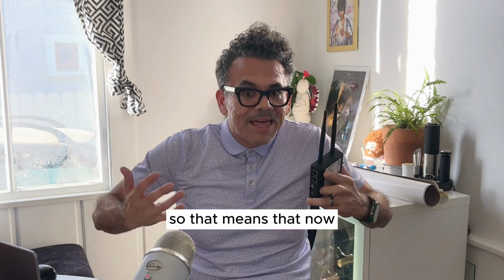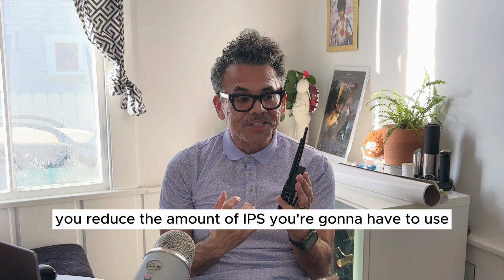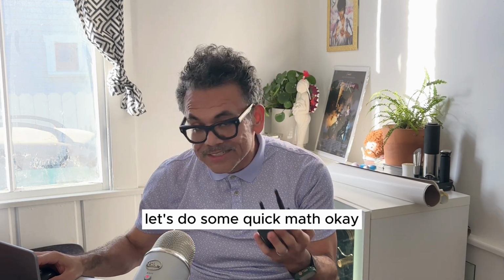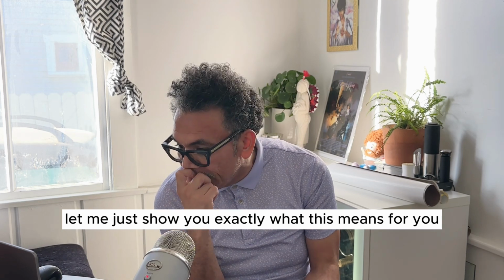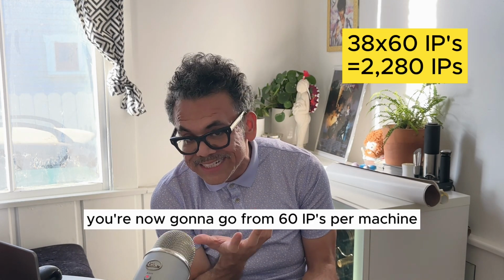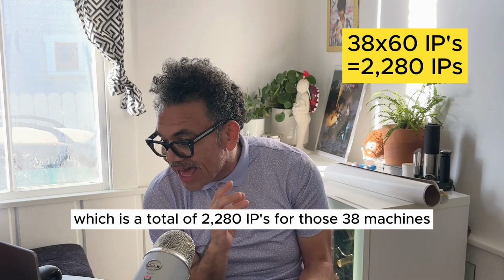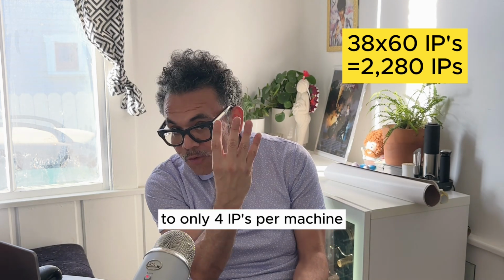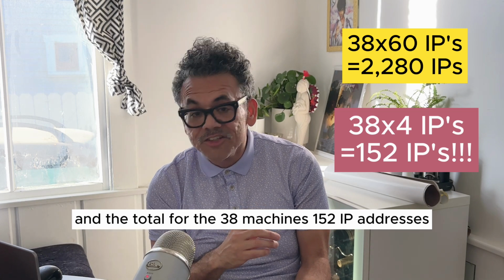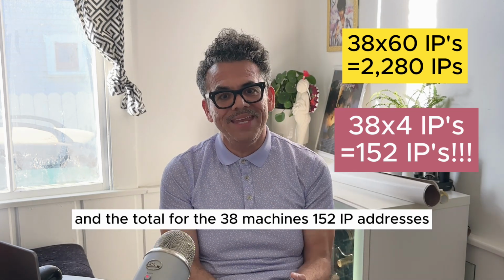So that means that now you've reduced the amount of IPs that you're going to have to use. So you're going to go down from, let's do some quick math, okay? Let me just show you exactly what this means for you. You're now going to go from 6 IPs per machine, which is a total of 228 IPs for those 38 machines, to only 4 IPs per machine, and the total for the 38 machines, 152 IP addresses.